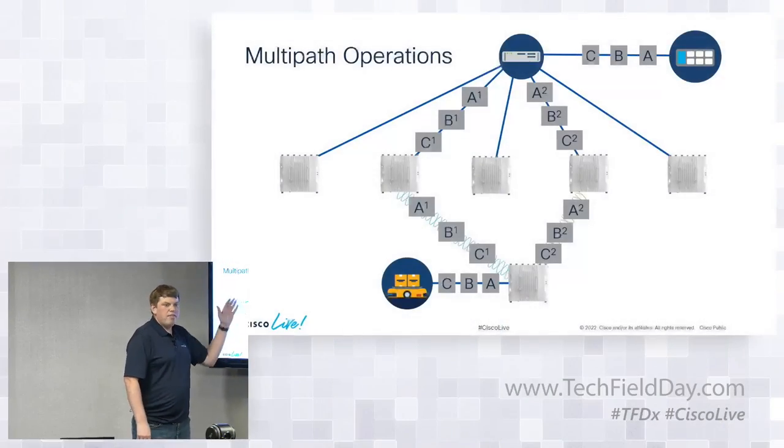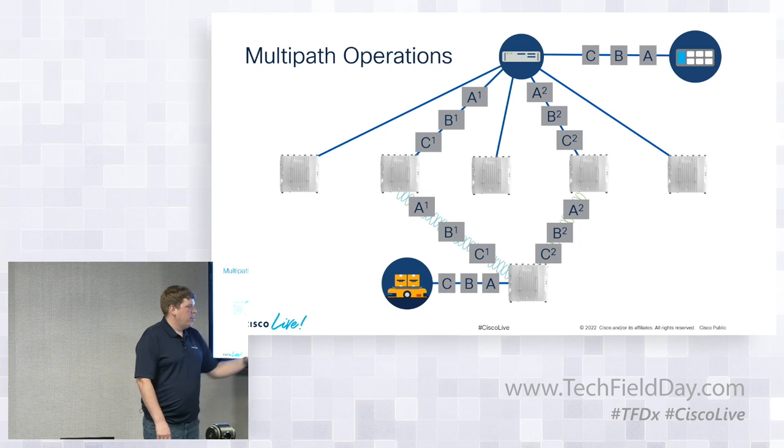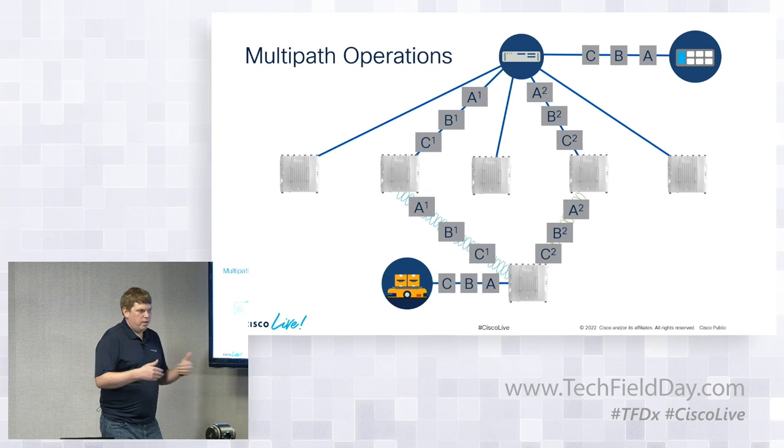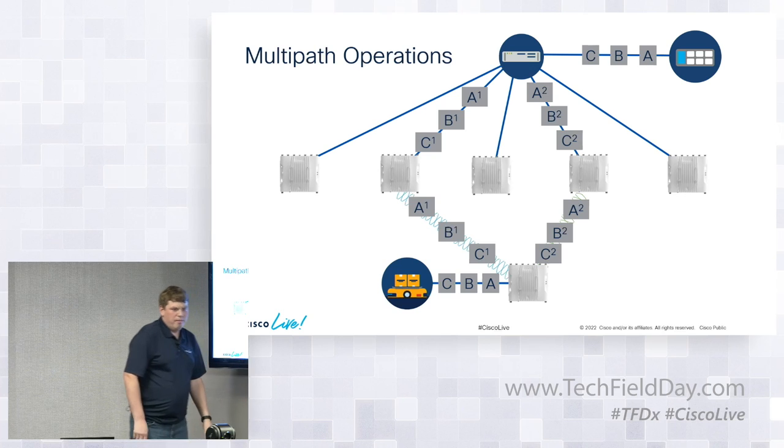When deploying this, it has connections to multiple waysides. When the AGV comes into a new area, it doesn't immediately start sending traffic to a newly seen AP — it needs about a second. But by having that second radio, even at low signal strength like -85 dBm, when starting to approach a door it's already talking to the other radios, forming that path, getting ready to send that second stream of data, and eventually making that its primary path while choosing a new secondary path.